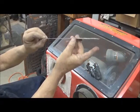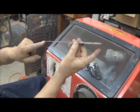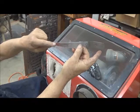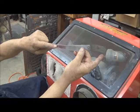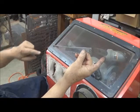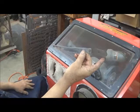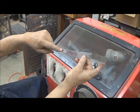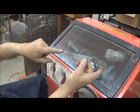Seen in this direction, there is a bend right here, and these scratches here on the surface are where it underwent great stress and it was taken beyond the elastic limit of the steel. That bend is best just removed altogether. So the profile of the blade, actually the point, is going to start about here, and we'll reduce the thickness of the blade accordingly.